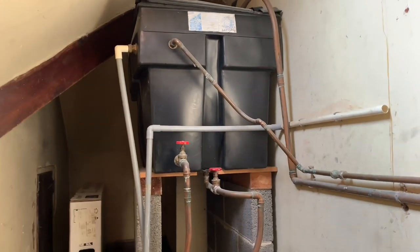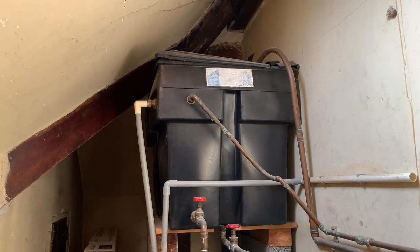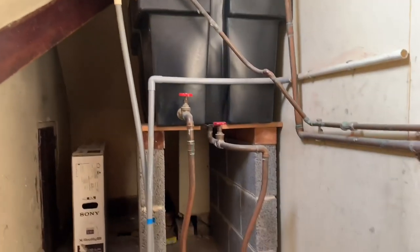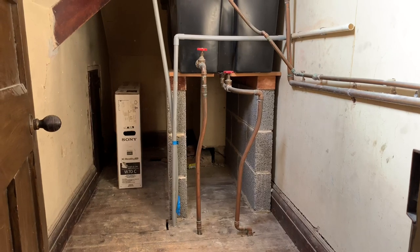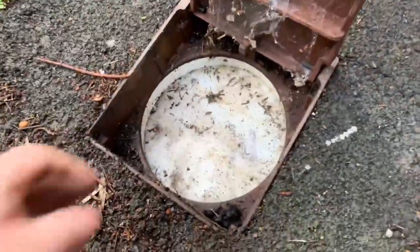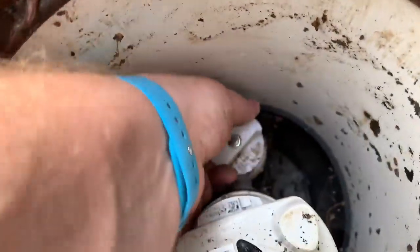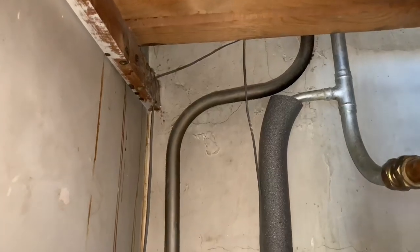I'm going to drain this system down. I'll show you the old system, we'll drain it down, and then I'm going to connect it into the new boiler that we've installed. I'm going to turn the water off shortly, but this is the header tank here and that feeds — the cold water goes into the bottom of the hot water cylinder. We've got two feeds there, which would indicate there's something that's tank fed, like a bath or maybe a shower. So we've got the water off now. I'm just going to do the stop tap outside on this house just because it's plastic so it's much easier just to turn off. So just turn that off now and then we'll drain the tank down.